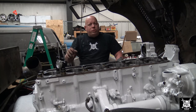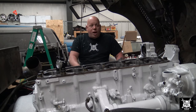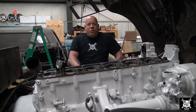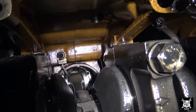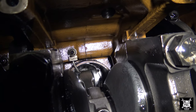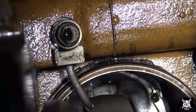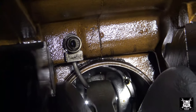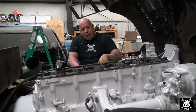I took the valve covers off, took the jakes off, cleaned up the top of it, pressure tested it, cleaned it up, pressure tested it. 3 to 4 days of pressure testing, and I couldn't get more than a half a shot glass of water out of this engine. The most water I found were literally drops. I mean, we're counting drops. I mean, I was seeing water droplets in my dreams, okay? And it was all seeing me hovering around cylinder number 3, but not on the liner down the block.